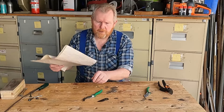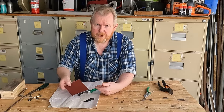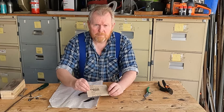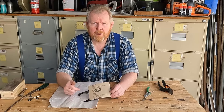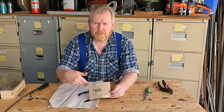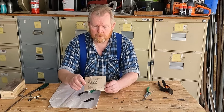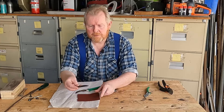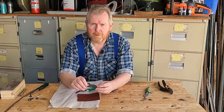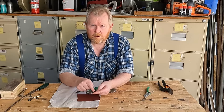This jaw isn't a cutting edge — it just works as an anvil for the sharp cutting edge of the blade to work against. I'm going to clean these surfaces with sandpaper, but it's a dirty job so it's a good idea to lay a piece of paper on your workbench first. The sandpaper I'm using is nothing special, just 120 grit. Anything around that grit will work fine. If you use anything coarser you'll leave scratches; go too much finer and it'll clog up quickly.